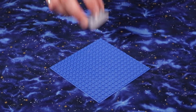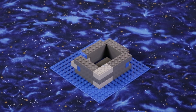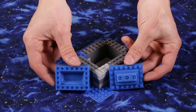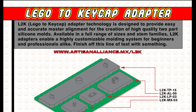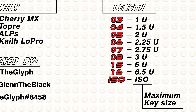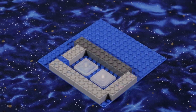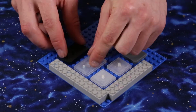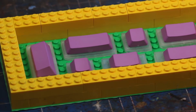Using an L2K saves you an immense amount of time and hassle, and you'll end up with higher quality molds. L2Ks come in a huge range of different sizes, but still work exactly the same way when casting larger keys. Whether you're just looking to cast some mod sets or have some crazy oversized sculpt, all you have to do is check the L2K datasheet to figure out what size adapter you'll need. Many professional casters like to use multiple masters within one mold to increase efficiency throughput. L2Ks can be tiled within larger mold boxes, giving you complete freedom in how you structure a production workflow.